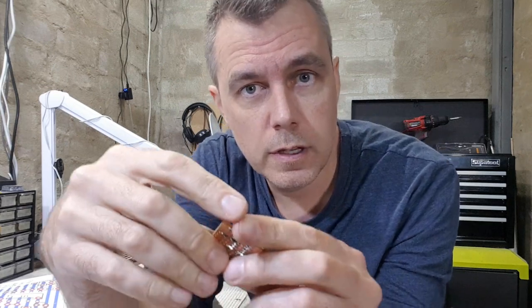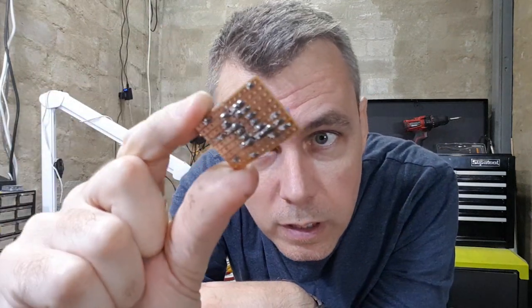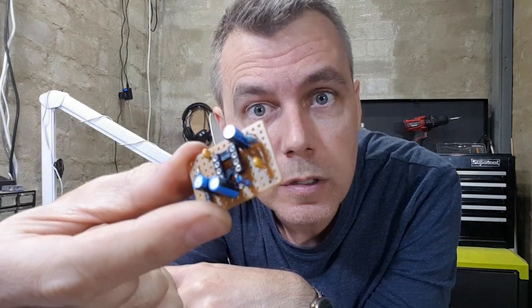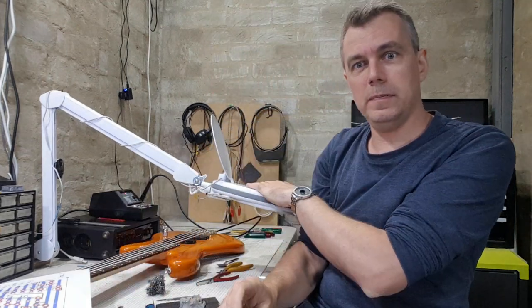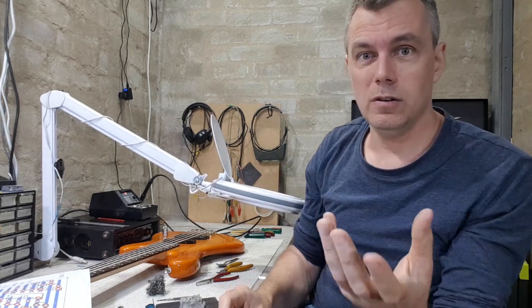Okay, so there's my little circuit board. It's not quite complete, as I mentioned, but I think that'll be enough for this video. But I do have to check that all the soldering is good, and that there aren't any solder bridges across tracks or between parts. The way to do that is with magnification and good lighting. To be honest, I normally solder with my magnifier and my light, but on camera it makes it strobe, and it also throws the white balance off.